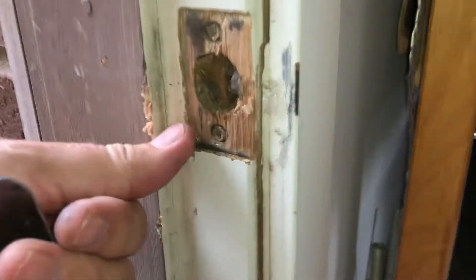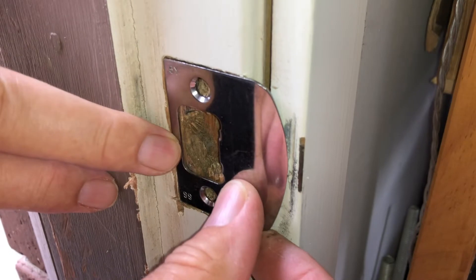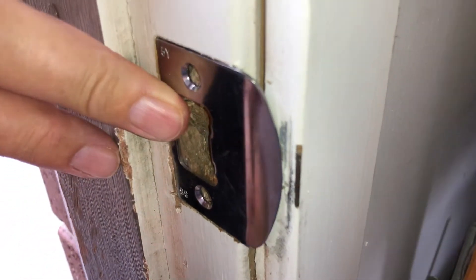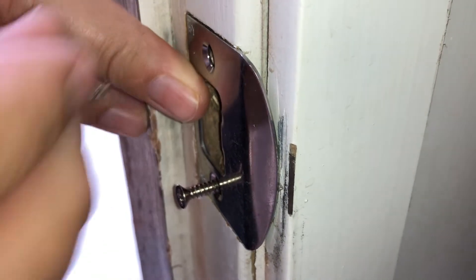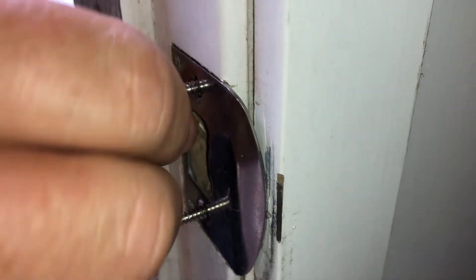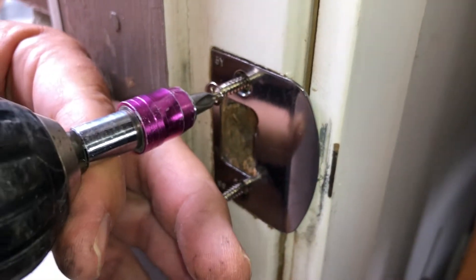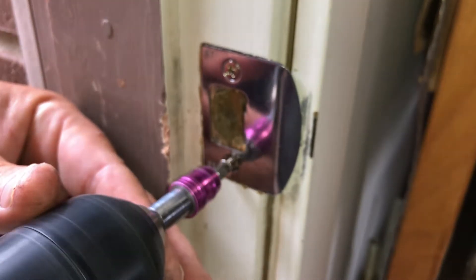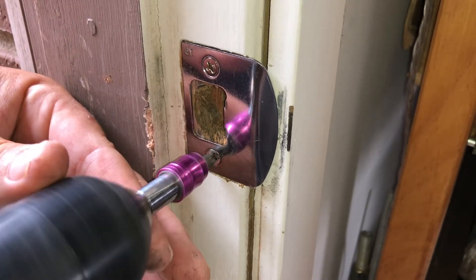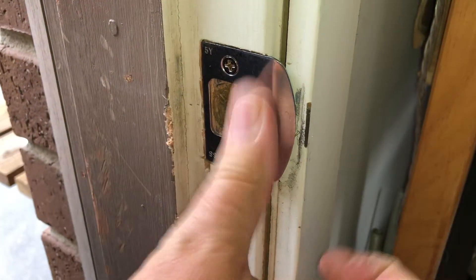Because I've bought a better quality lock, I want to put better quality bits all over. This is very standard — the chisel marks are the same, the screw marks are the same. The new striker plate goes in. As I said, this totally doesn't have to be replaced, but I'm replacing the screws, the whole lot because it is a better quality lock. That's now in nice and tight. Beautiful.